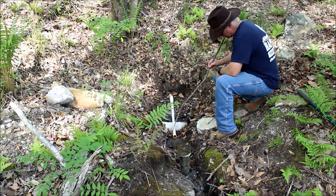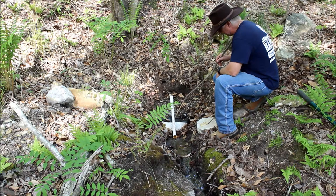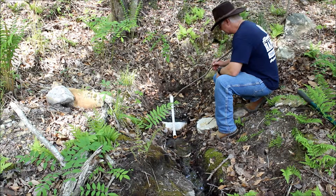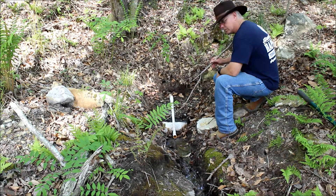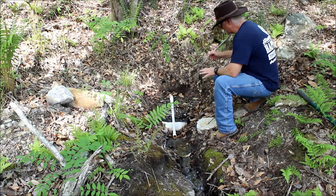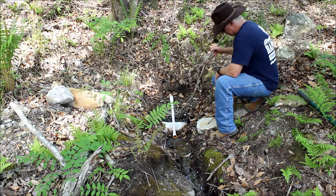This here is my overflow. It's actually at the top of this dam or reservoir I've created. What we've got here is this is full of gravel — number 57 washed gravel — covered with plastic, more gravel on top. Ideally I need to get this cleaned off a little better, put a little more gravel, another sheet of 4-mil plastic, and put more gravel and then cover this with dirt all over real well to keep anything from getting down into this spring reservoir.